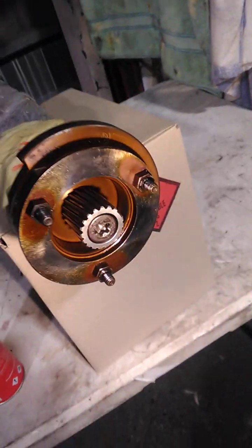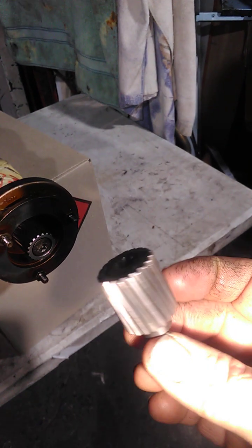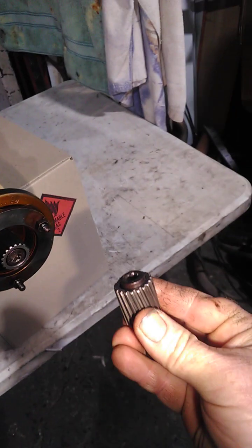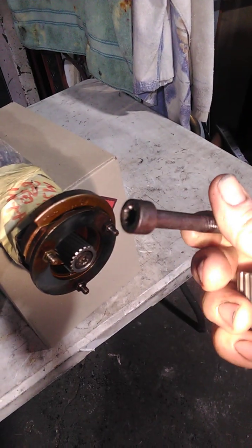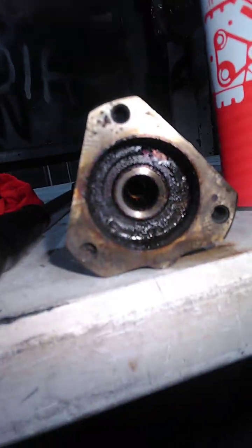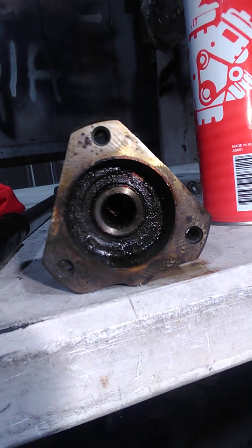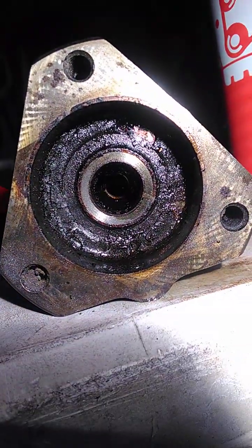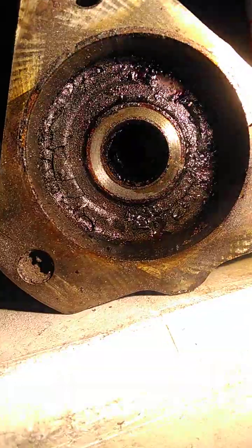Modified Vanos. See the bolt's level here. Usually, when you cut 5mm off this sucker, the bolt will sit slightly proud. Also cut the inside of it down. Don't cut the bolt — bolt integrity is super important for how tight these end up. So you cut the inside down. Now let's look at this one. See all the gunk in there? We might have to turn the torch up. See all that gunk inside? All that crusty, black, burnt synthetic oil.